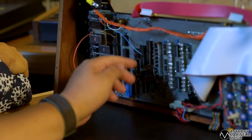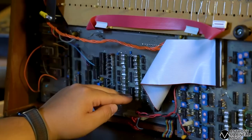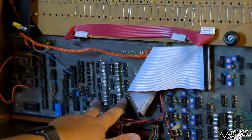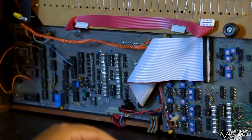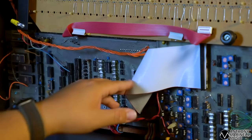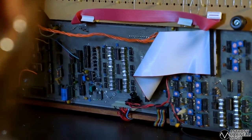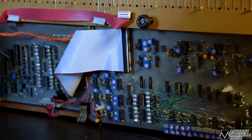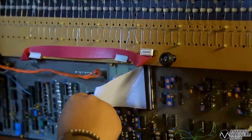The signal flow goes left to right. After the DAC, that gets into these 4051 multiplexers in a demultiplex fashion, where it's then sampling and holding those values into these various buffers - what's called a voltage follower. These are the capacitors that hold the voltage. It's basically spitting out the voltage that the pot is at many times per second, and this capacitor is holding that voltage. When these caps fail you have problems, and these op amps fail too - well, everything in this thing fails. It's a very early product. The miles and miles of wire you see in the CS80 is all replaced with this 50-position ribbon cable right here.